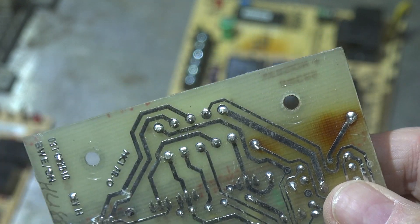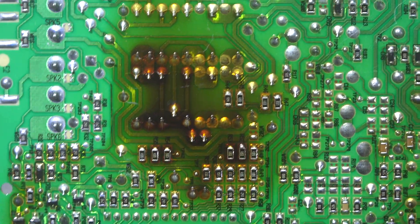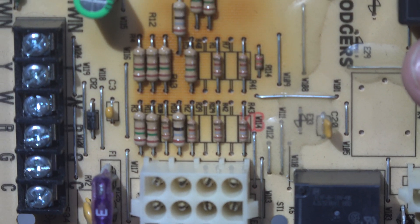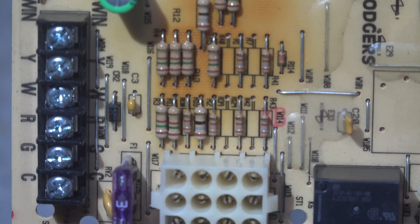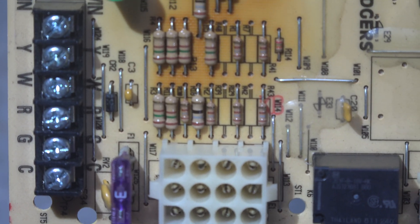Let's look at a couple of others. This one here — if you look at the back side, it looks pretty bad, doesn't it? Looks like there's a lot of burning. Look at all those resistors — the circular components with the bands on them are resistors. They've been dissipating heat into that board. There's nothing necessarily wrong with it; resistors can actually get quite hot without damaging themselves.